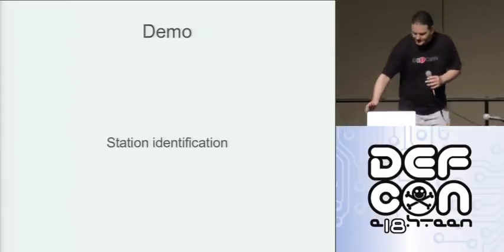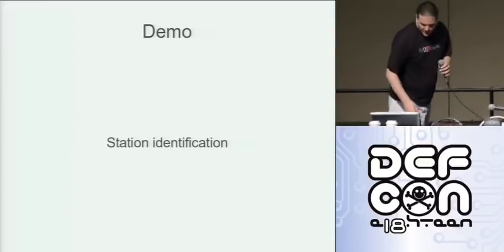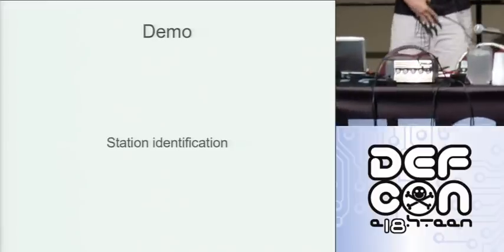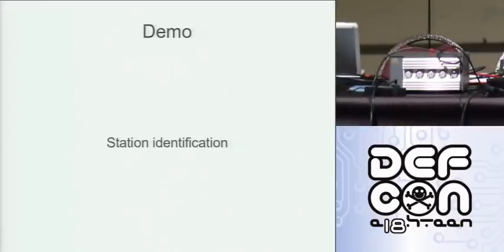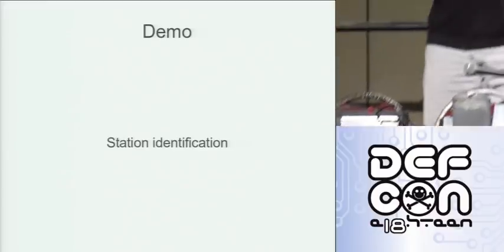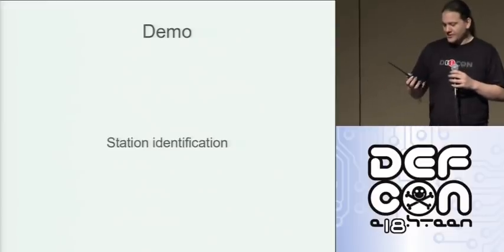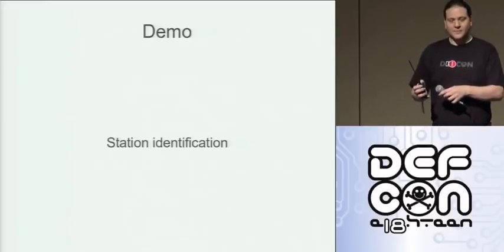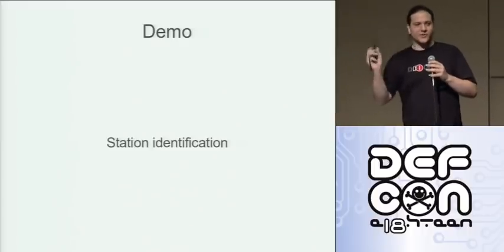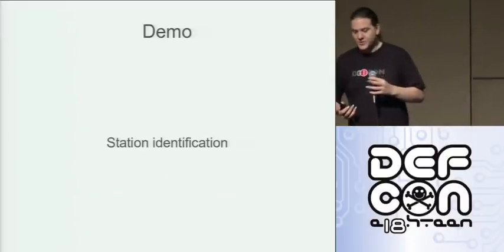What I'm going to do here is... Okay, so I've just started the RFID reader. Turning on the power amp, cover your bits. So what I have here is a little ham radio receiver that's tuned to the frequency that I'm transmitting on. And if I turn the volume up here for a second, so that clicking, each click is a bunch of commands from the reader telling the tags to wake up and activate and do their thing.